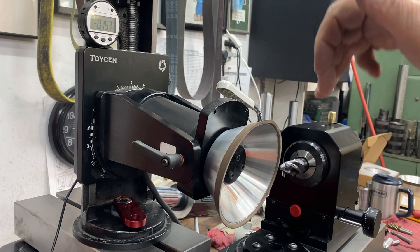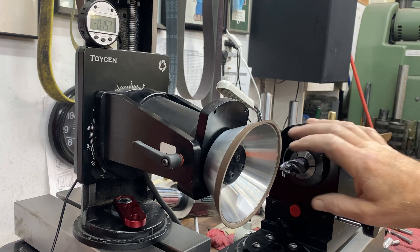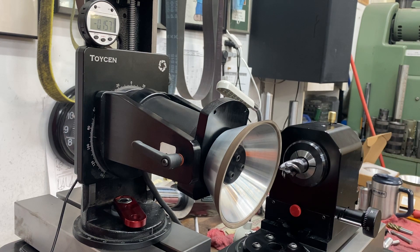Anyway, if you pick up the square of your flutes with a square before you start, and then just rotate them over 90 degrees, you'll be able to grind the end of each tooth — each flute — independently, and they should all be the same length. Thanks for watching.